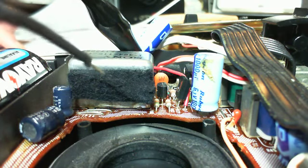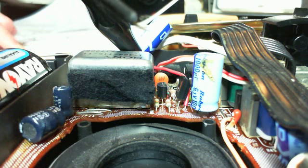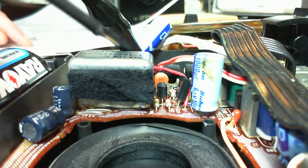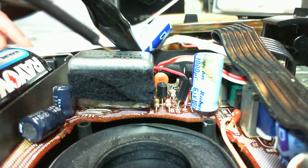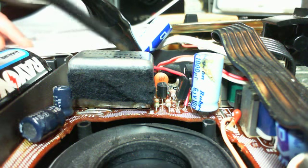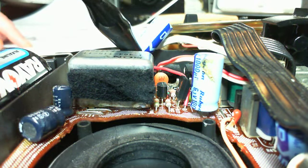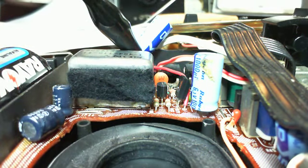Okay, let's look at the other side of the DC to DC converter. There should be 18 volts, and that should show up on Q33. And you know, I'd say collector or emitter, but frankly I'm always getting these confused. On a pin that's not the base, let's put it that way. Now where would that be? Q33 could be anywhere, for crying out loud. How am I going to find Q33?